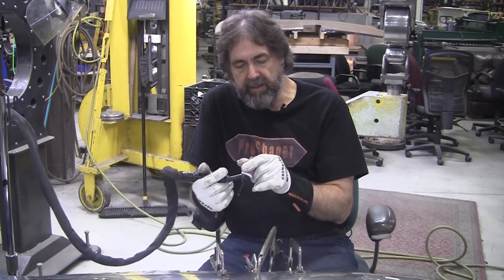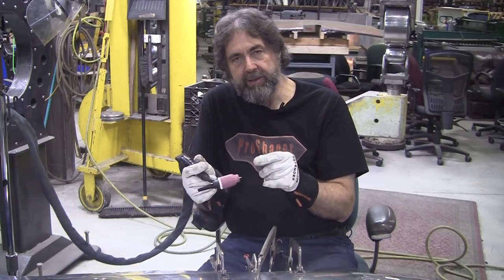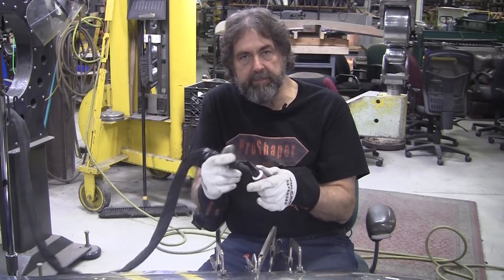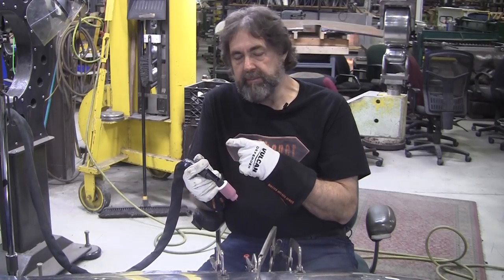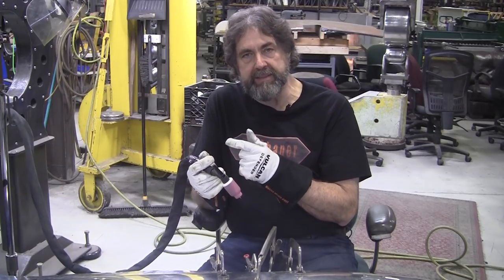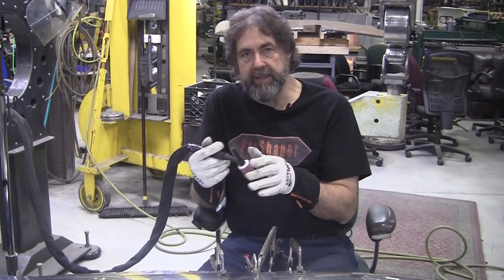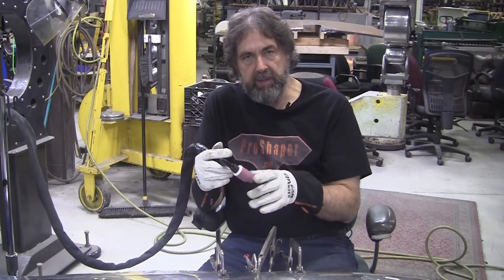Now, the other breakthrough, another guy, he came in, and he was a really good TIG welder too, and he reinforced what Joey had said about the bigger gas lens and the bigger cup. So here I am with the bigger gas lens and the bigger cup, big improvement. And one of the things that this Everlast 210 EXT power TIG welder has is the pulse capacity. You can set all kinds of parameters on this machine, and you can spend a whole day, which is what I did almost, trying to find the optimum settings, and especially using the pulse.